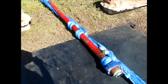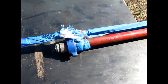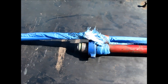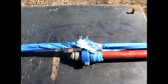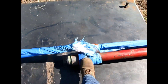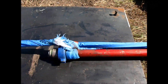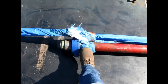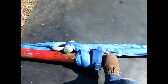One of the things that I'd like to point out that I'm very proud of: when you use the half hitch method like this versus the rib and spine, when we were testing with the rib and spine recently, each time on a separation, that rib would pull out of the hammer union area here, exposing however long an 8-foot joint of pipe. But with this half hitch, if you'll notice how it pulled right up against the hammer union here and also here — that controls the end of that pipe.